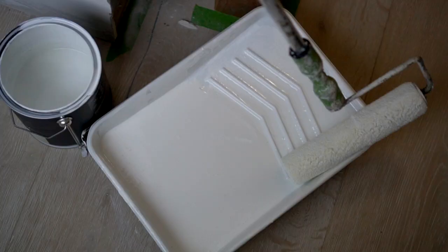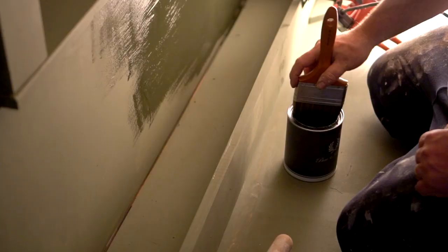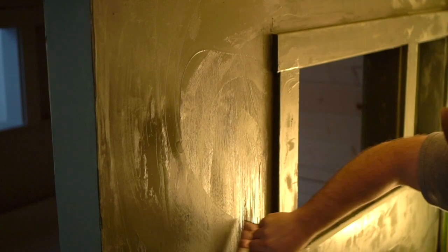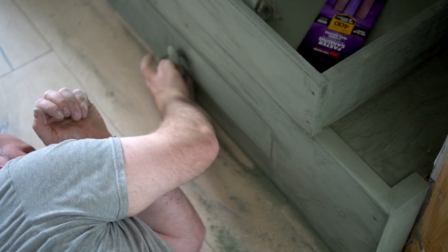Here is a quick rundown on applying Marrakesh — check out my other video for a more detailed look. We first needed to use their specially formulated Wall Prim primer to cover the sheetrocked walls. Then we brushed and rolled on a thick layer of Marrakesh paint, and once applied in a section we could go back and trowel the paint around to emphasize the texture, movement, and depth. After letting it dry and cure, there's a slightly messy step: we took 400-grit sandpaper and ever so lightly sanded and smoothed the walls, which brings out more depth and texture but leaves paint dust around. After a curing period, we applied their dead flat Eco-sealer to make it washable and more durable.